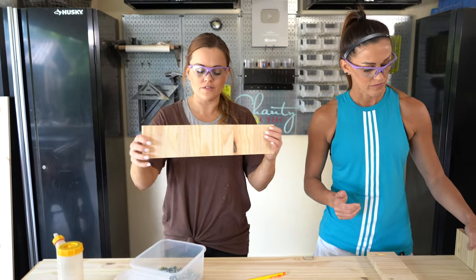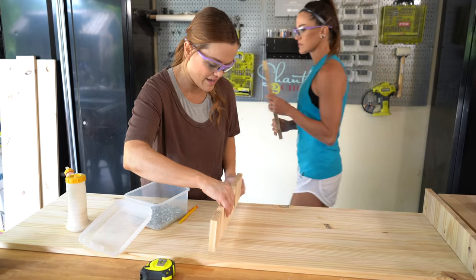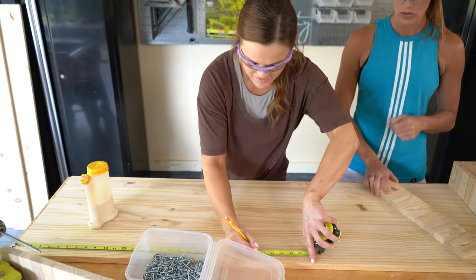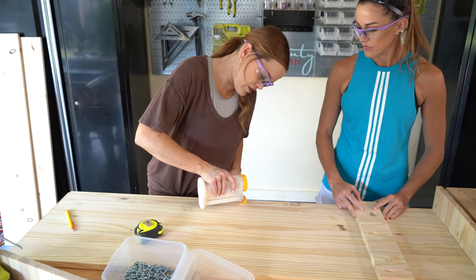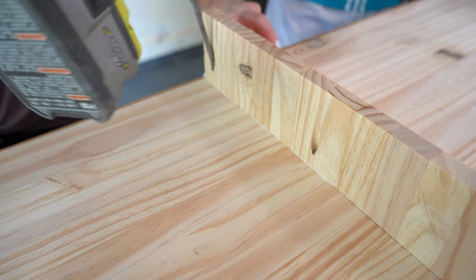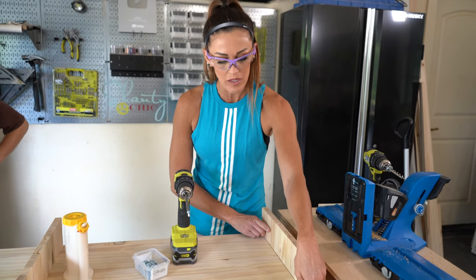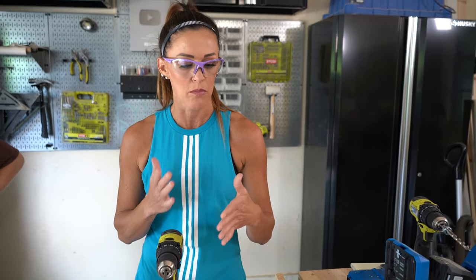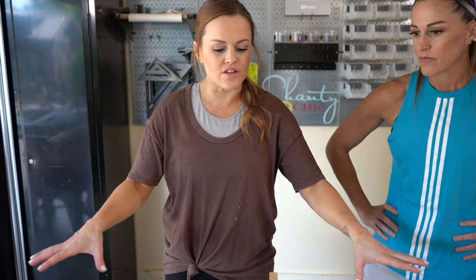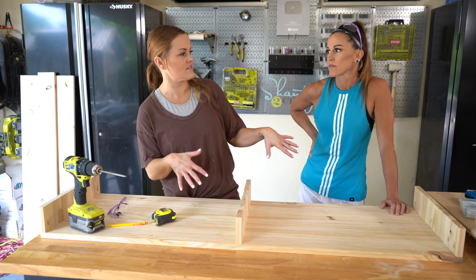What we're doing now is adding these boards to our top board — this one is going to be the actual top of the table, and the one we add last will be the bottom. I'll start with the center one and mark center on this side too. I'm adding a line of wood glue and attaching these with pocket hole screws and wood glue. I'm using one-inch pocket hole screws — this laminated pine is a little thinner than three-quarter inch, so keep that in mind. Now we've got our sides on the top of the table, and we're going to pause and add hardware while it's still easy to access.